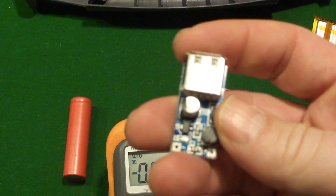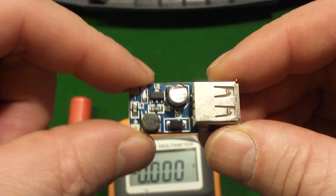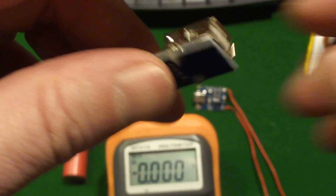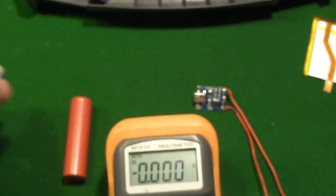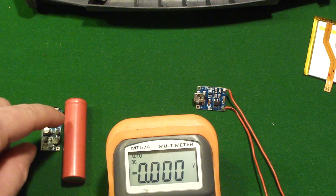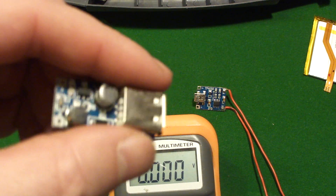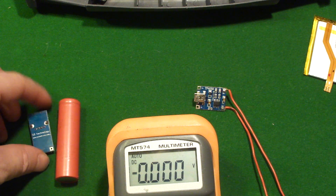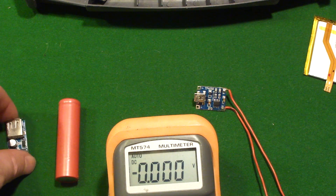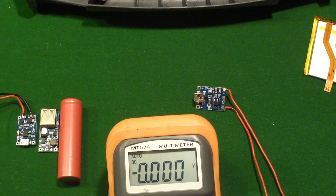There are lots of interesting things. This one is a little converter — you put some amount of volts into these two mount points, I think from about 0.9 up to 5 volts, and this module will play little games with the power and give you USB 5 volts out of a battery that isn't 5 volts. The efficiency is fairly high — you lose a little into the circuitry — but this will actually give you 5 volts for your project in a very small, cheap package, maybe 20 cents each. So a circuit for charging and discharging combined with a circuit like this can very nicely manage your power requirements for many little electronic projects.